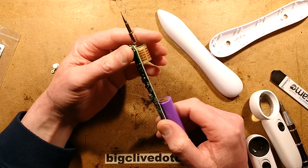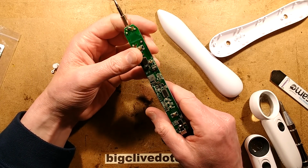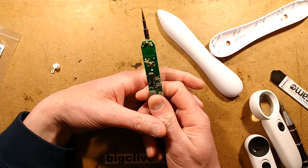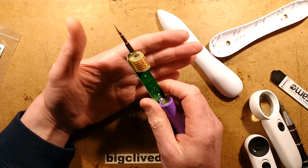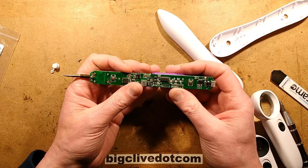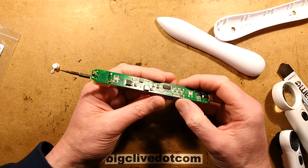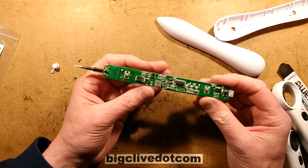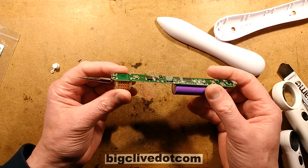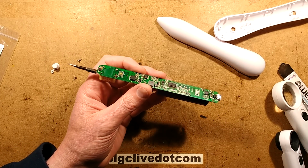I wonder what other applications there are for this. Driving a little neon tube, but then it's already shown it tends to crash when you do that, which is odd. Maybe that's why they are so cheap. Maybe they've built these and then discovered that there is that slight high-frequency RF issue that causes microcontroller problems. So maybe not great for its intended purpose. I mean, some people will use it for that. But for us, it's a complete candy box with the battery inside and the charge circuitry and the special transformer at the end. It's really quite neat.